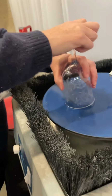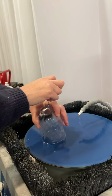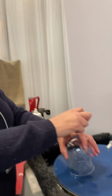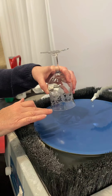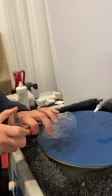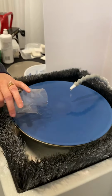How often do you depend on the noise that you're listening to decide whether you're close or not? Well, it's not so much the noise as it is just feeling it, with touch. And as I'm rotating it, you can still see the chip each time it comes around. So at the beginning you'll know how far to go down. But when you get to those microscopic little chips, it really helps with touch, and seeing it, holding it against the dark background.